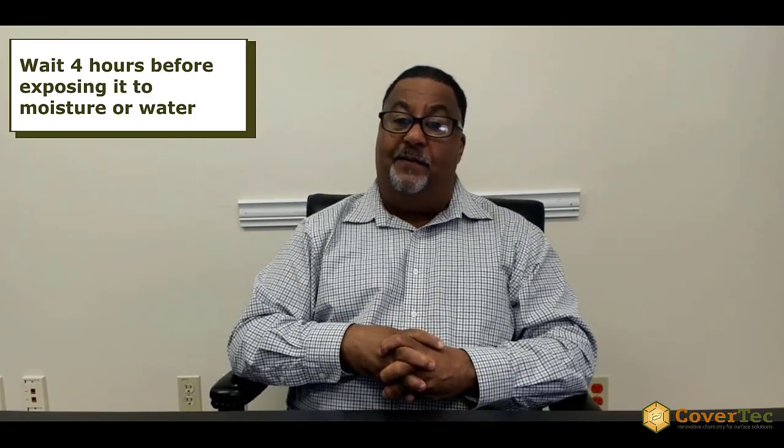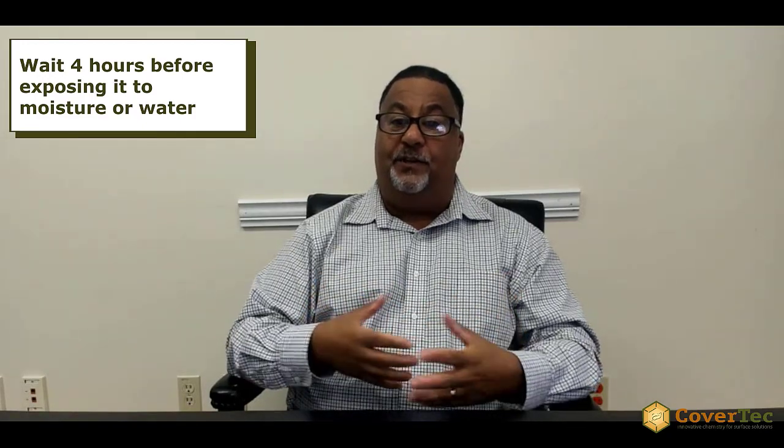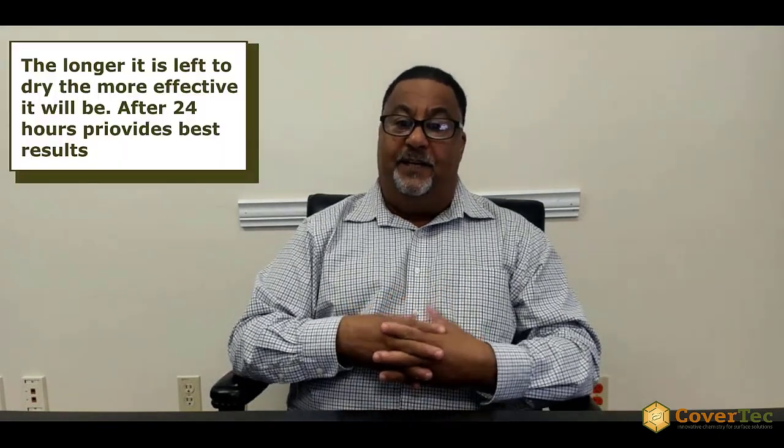We always recommend that you wait 4 hours before exposing it to any moisture, any water. You will be able to walk on it within 1 hour, 1 to 2 hours, depending on the temperature. But you should plan to keep any water, any moisture that it might be exposed to for at least 4 hours. And after that, you'll find it can be driven on, it can be walked on, it can be exposed to moisture. The longer you leave it, the more effective it will be.